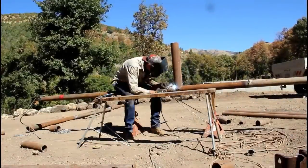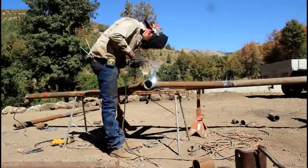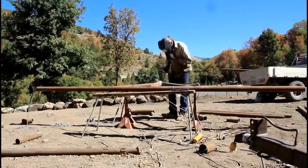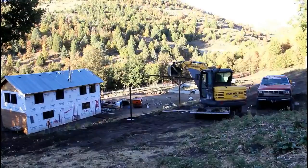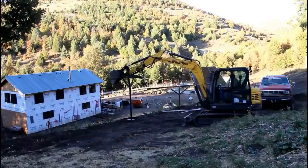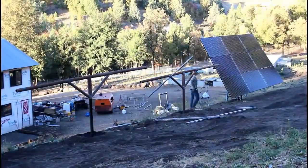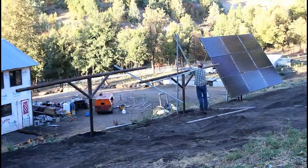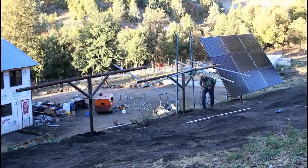After building the first solar panel mount, I decided to add a little bit more bracing and beef it up just a little bit before building the second and third mounts. Because I had built the first solar panel already, I was able to pull measurements off of it, and the second and third definitely went faster. Between the 45-degree bracing I did on the horizontal supports and the horizontal unistrut I did at both the top and the bottom of the panels, I feel more than confident that it's not going anywhere.